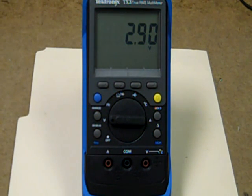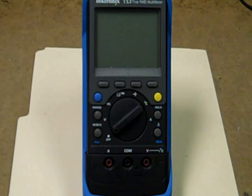There's an interesting function — you can check the battery voltage directly from the front of the meter on power-up. Press soft key number 4 on power-up and you can measure the internal battery voltage. It gives a low voltage indication when the internal batteries are at 2 volts, and it cuts out at 1.5 volts, squeezing just about every bit of life out of those batteries.